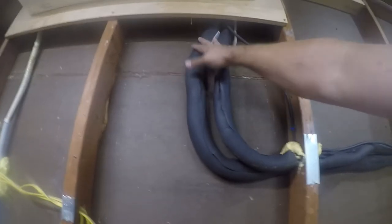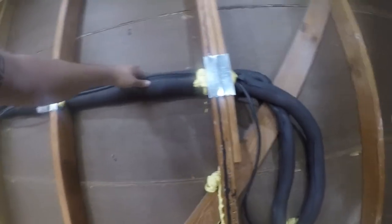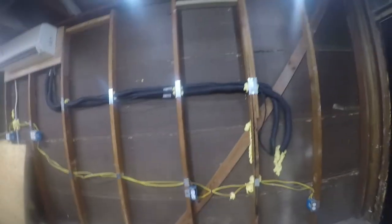Okay, so there you go. I have re-insulated the lines where they go through the wall. Cost me about $25. This stuff's about $5 to $7 a piece. I use two pieces for each size. This is 3/8 line, but I went ahead and used 1/2 inch insulation. It'll be okay. I don't know where you'd really get 3/8 insulation. Maybe an AC house, but most of theirs is designed to slip fit over the line set before installation.